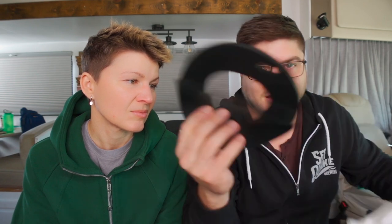We're getting closer to getting back on the road. We have projects we need to do, but the first one — we've been full-time in this RV for over a year and they're not necessarily built with that in mind. One of the things is the way the toilet's designed: it has a rubber seal that sits on top of a little flap that opens and closes, and that rubber seal looked bad, so we get to dismantle our toilet. We did this a year and a half ago. I think these new ones are better because they have a little hole in them, which our toilet needs.